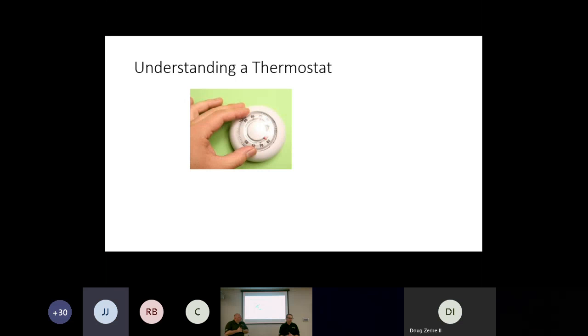Yeah, the only one on chat, until anything else comes in, is we just got one, and it has to do with the press fittings that we talked about earlier. And they're asking how would we use that on our condensers and coils because of the bells, the expansion. My opinion, quite frankly, is Trane recommends braze. So anything you do other than that, you're on your own.